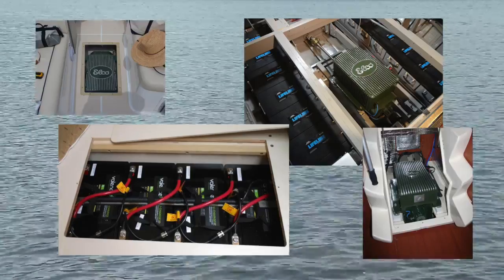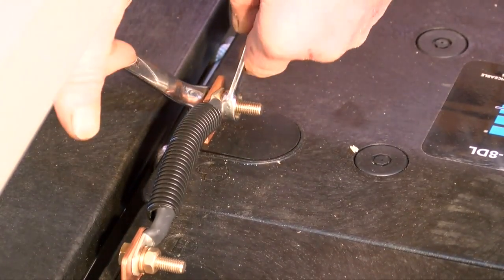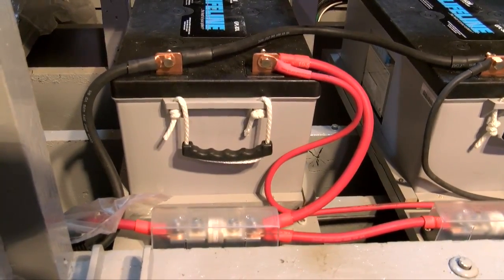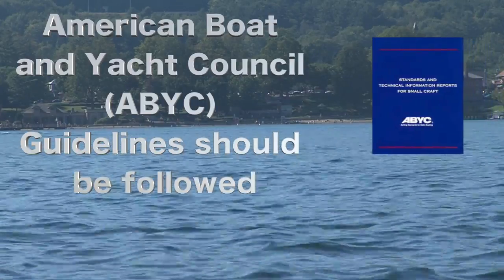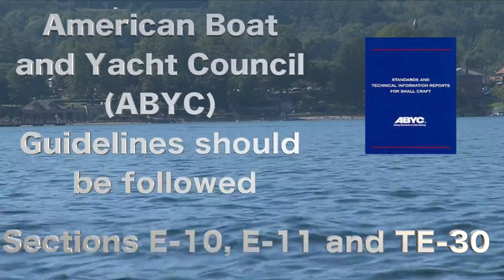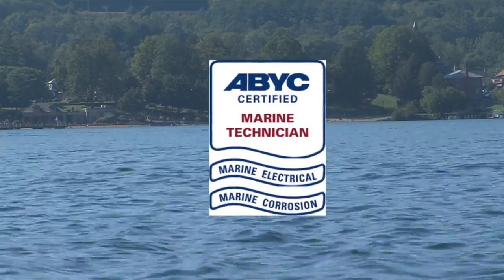Batteries are like the fuel supply for your motor and battery cables are like the fuel supply lines. Similar to any fuel system, batteries and cables must be the correct size and capacity and installed correctly to ensure safety and reliability. ELKO emphasizes that all electric cabling and wiring must be done in accordance with the American Boat and Yacht Council guidelines. The ABYC publishes these guidelines in a Standards and Technical Information publication. These guidelines are found in sections E10, E11, and TE30. TE30 pertains specifically to electric propulsion systems. You should become familiar with the standards or work with someone who is knowledgeable before commencing work.